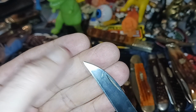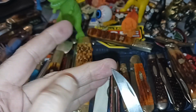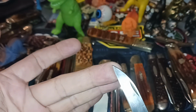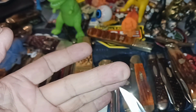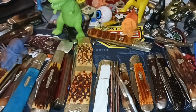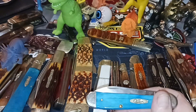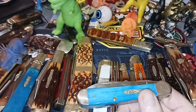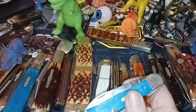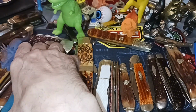And what'll really do that a lot is a belt sander. If you pull it too far past the belt, like they say, my finger is the width of the belt. That's as far as you should go on a belt sander when you're sharpening a knife. If you pull it all the way up like this, it's going to round the tip off. Believe me, I've made that mistake a lot of times. A thing to remember about mechanical removal of material is it happens fast. Mistakes happen fast, the material comes off fast. With hand sharpening, you can see, hey, I'm starting to make a mistake here, before you get carried away. So that's just a word of caution there.